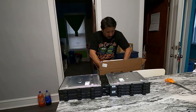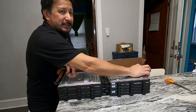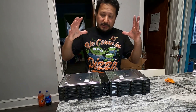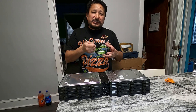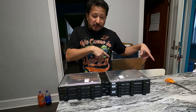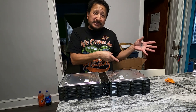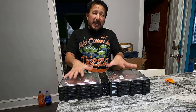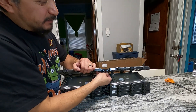I'm doing a hobbyist solar system with a 3000 watt Growatt inverter. I'm going to get a kilowatt usage meter to check my fish tanks — I've got one power strip with six outlets running three fish tanks and a boat battery charger. I'll plug the kilowatt meter in to see how many watt-hours that uses in a 24-hour period, then calculate monthly usage. I have heaters on two of the tanks, so I'll know if the solar and batteries can supplement that load.